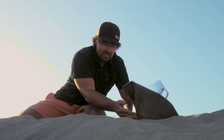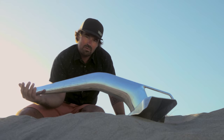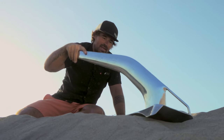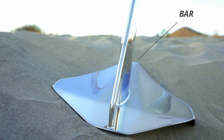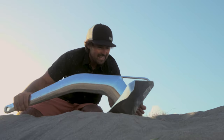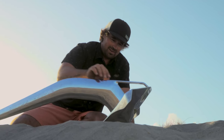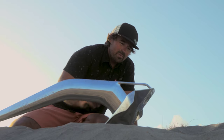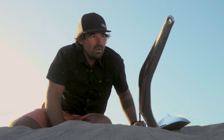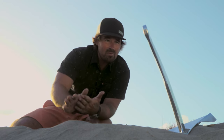The other advantage of this big fulcrum is that as the anchor goes from its set position and we come to release it, it acts as a fulcrum to release it from the ground — but only when the chain is directly above it. Very clever. They've also got this bar to stop the anchor chain getting wrapped around the shank. It seems so simple, and it could also be used as a tripping line if you wanted. On the other end there's a really simple eye through the end, which may mean you need to go with the Ultra swivel — we'll be testing that in a later episode.